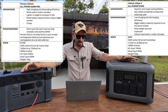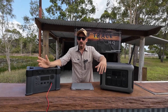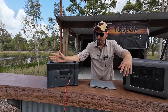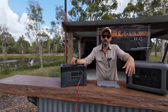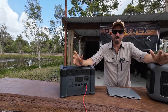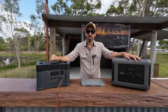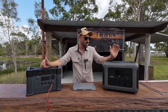So all in all, that's your stats — what you really need to know. Which one do I think is better? A lot of people are going to get scared with the ternary compound — ignore it, it's got a BMS. I honestly reckon the S series, yeah it doesn't look as nice, but you just get so much more bang for your buck. The size is better, the weight is better, bigger inverter, charges faster. I reckon this is way better. Unfortunately, because of concerns about ternary batteries exploding, not many people use ternary and are forced into LiFePO4s. I wish the market would go this way. But either way, if you want to be safe and go the phosphate, it won't let you down either.